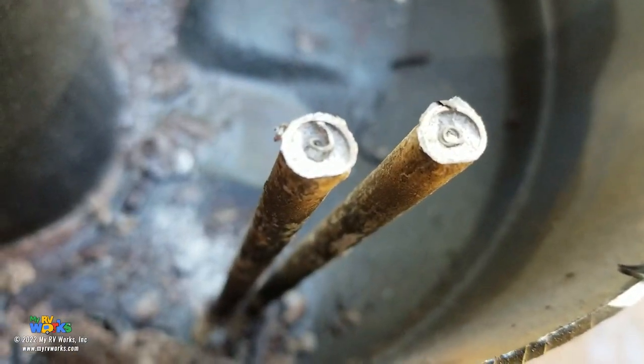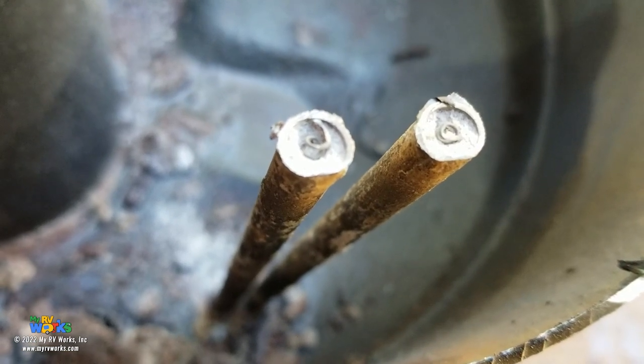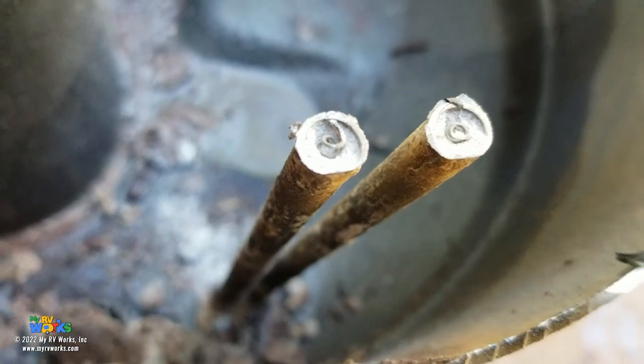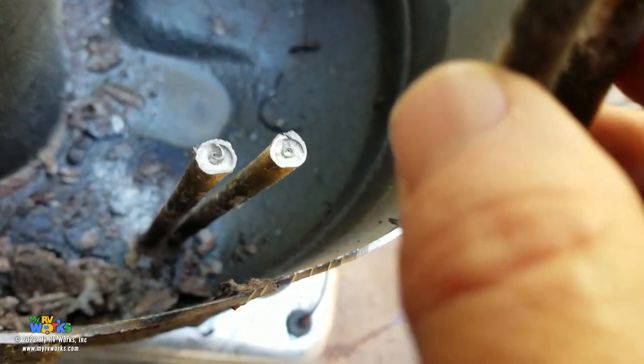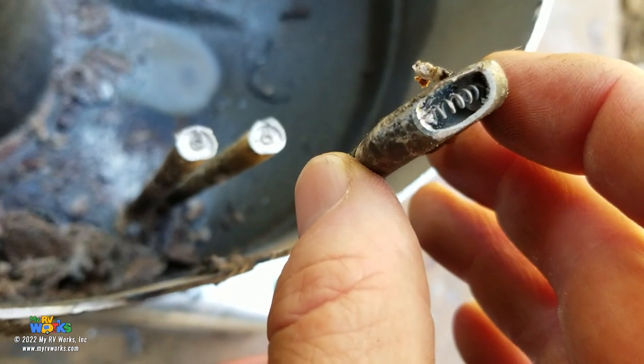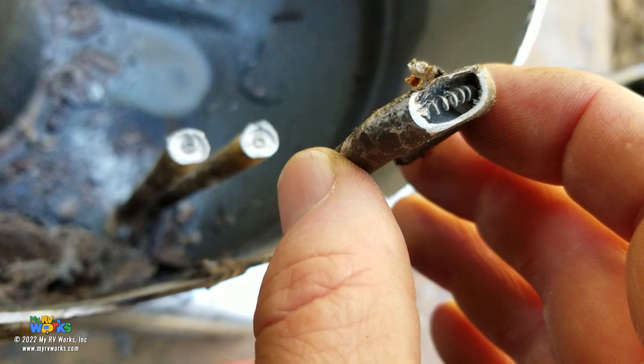And you'll see that that's basically just a winding spring, and it looks like they have some kind of heat transfer or something on the outside tube. And I also even sliced open the tip, and there's your spring. So that's the part that is glowing red hot, okay? These are 1400-watt heating elements.